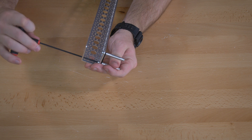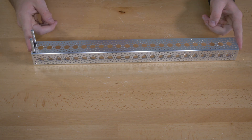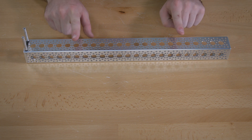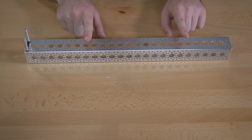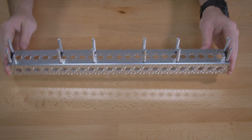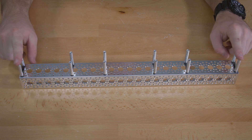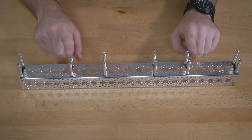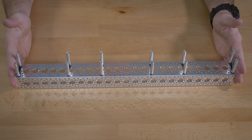You're going to do this step a couple more times — you're going to attach the spacers on the outsides. You'll attach them on the 12th hole from the top. If you're using the top sets of holes, you'll move in 12 and then move in 7. So you have the standoffs placed on the outside of your channel — move in 12 sets of holes and place them there, then move in an additional 7 and place them there.